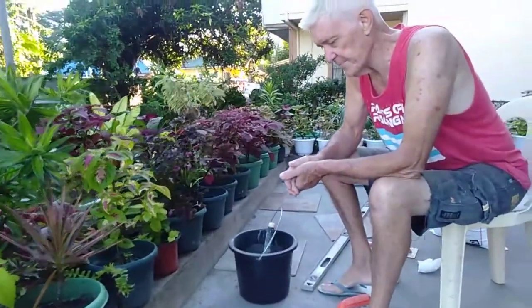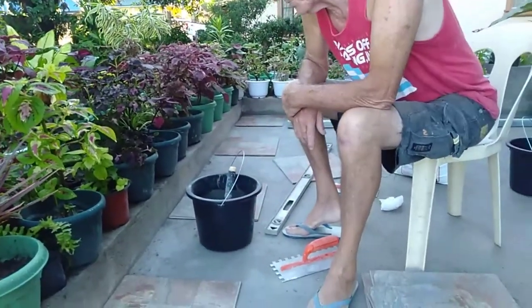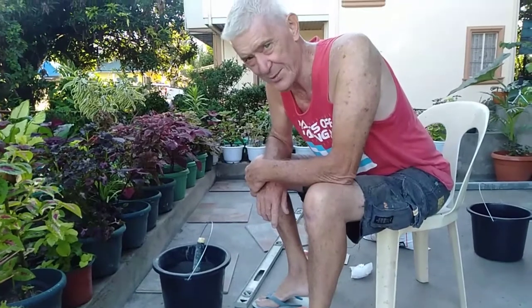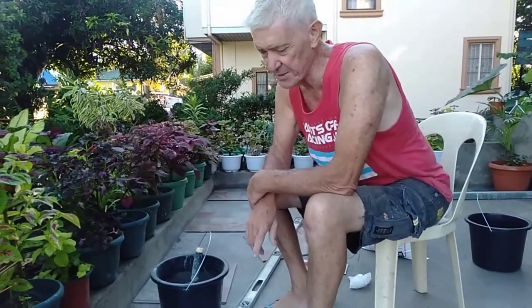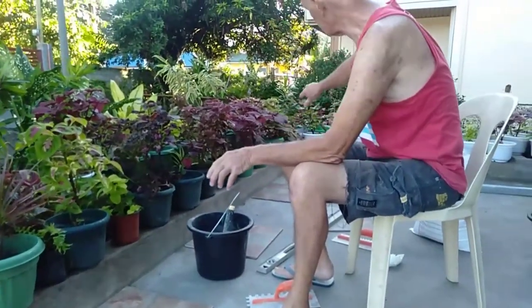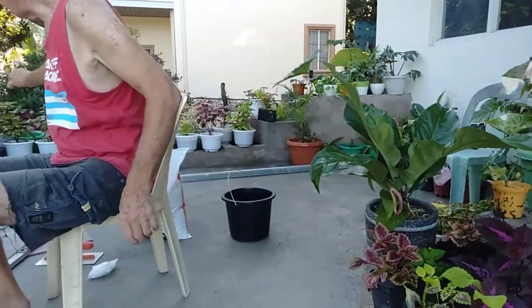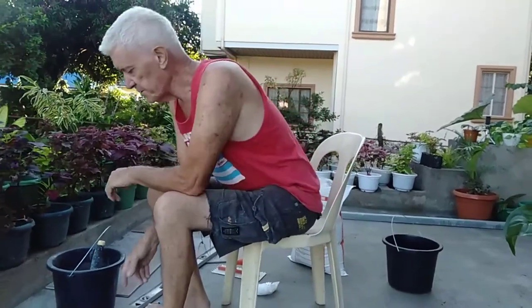Anyway, this is the tile we're going to lay first. So many people ask me over the years, how do you know where to start? And the answer to that is, I know. So it's wherever you decide you're going to start. I'm starting here because it's the point of overlap. From here, all the measurements have been made, and there's a cut along that wall and a cut along that wall. So that one's hidden, that one is so far away visually, it's not going to be a problem. So this is where I've done.